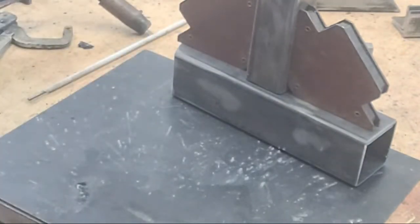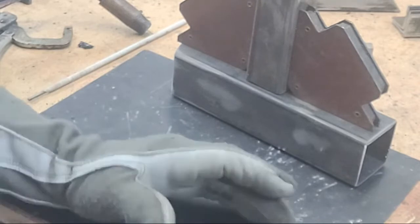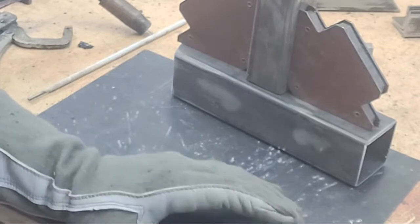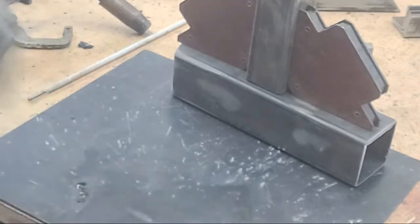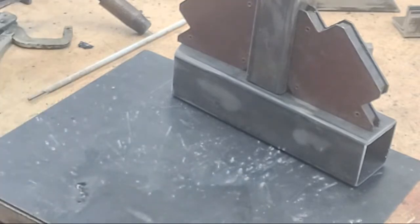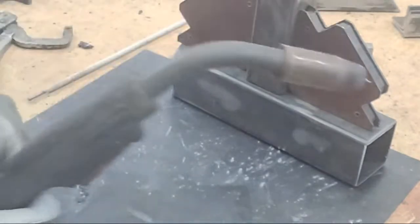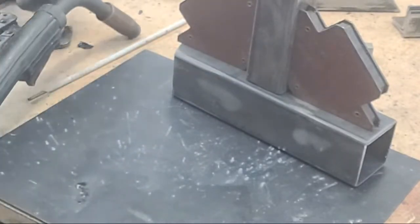The backstory on the aluminum welder — years and years ago I used to do a lot of aluminum welding on pontoon boats and aluminum tanks. The aluminum was so thick I could turn the welder as high as it would go and had plenty of time to make the prettiest welds, because the metal was so thick. But this thin metal burns through very quickly. With the wire welder, not so bad.